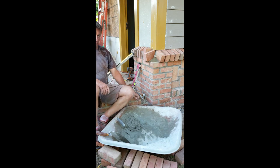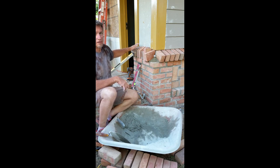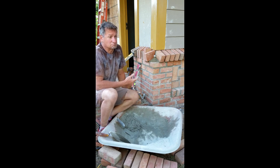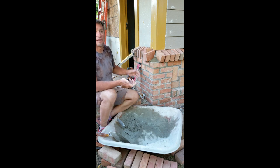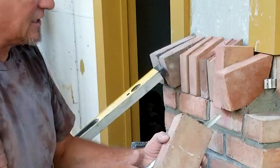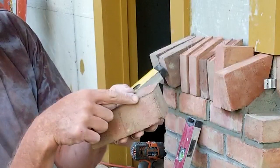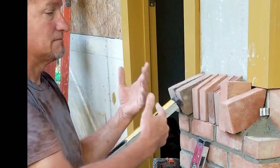The camera stopped and I ran short on room here because I decided to go this way and fill in separately. I ran out of room - measured it and was an inch and an eighth short over a short space. I divided it up by four bricks, then saw that the second brick had fallen at a different angle. So I took that brick and divided the inch and an eighth by five - it came out to three-sixteenths and a little change. I just cut that off each of the five bricks, set them out, and it looks good.